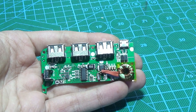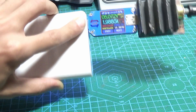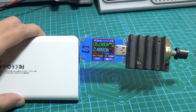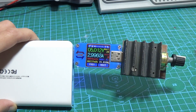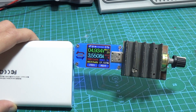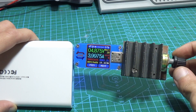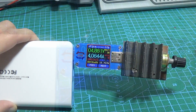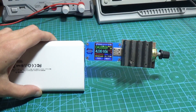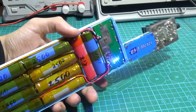Now let's see what we got. The maximum current before remaking was 2.2A. At 2A, the output voltage is stably 5V. At 2.5A, everything is fine. At 3A, the same. At 3.3A, everything is fine. At a current of 4A, it's still not bad — there is some voltage drop, but not very critical. What is the efficiency at maximum current? Around 73% to 75%? Alas, I forgot to shoot that measurement, and when I remembered, everything was already assembled — I didn't want to open the housing again and risk breaking the latches.